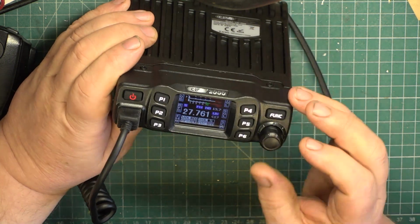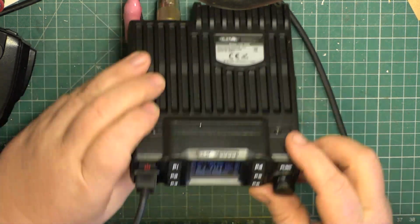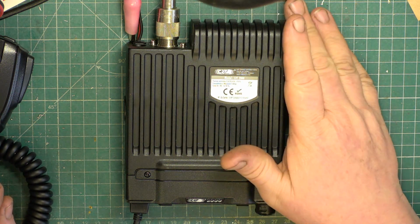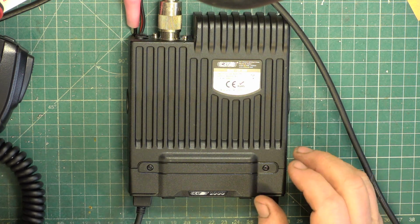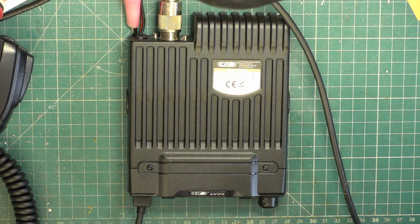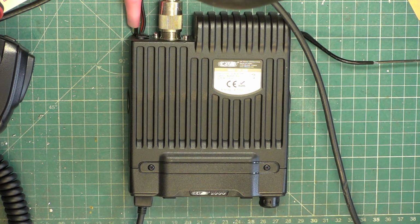Right, so channel 20. We also had one of these in the early days, but it had been messed with and it got a blown regulator IC, which we had to import from Taiwan. It wasn't easy to do because the whole board's got to come out. So I think there's a surface mount regulator IC. Right, I better print myself off a tick-off sheet.